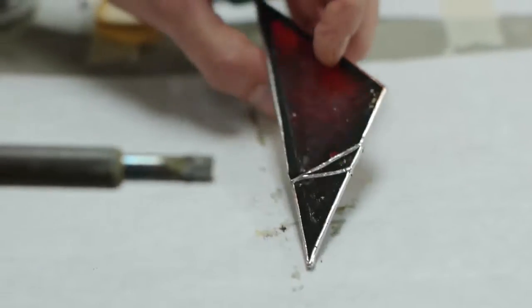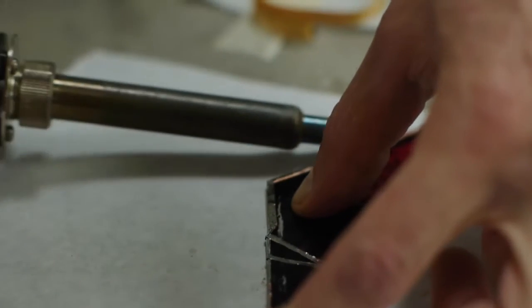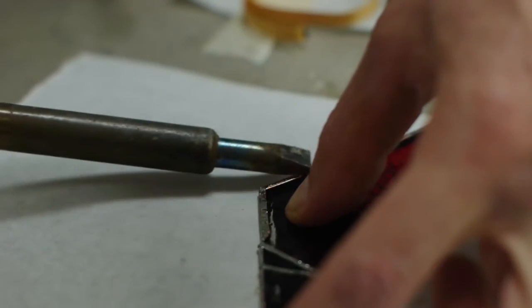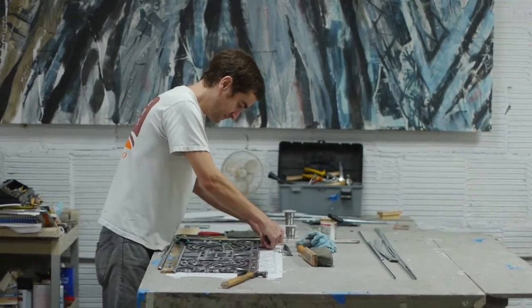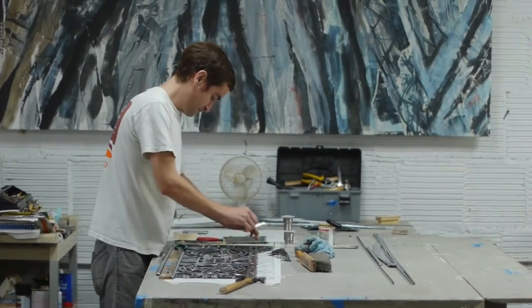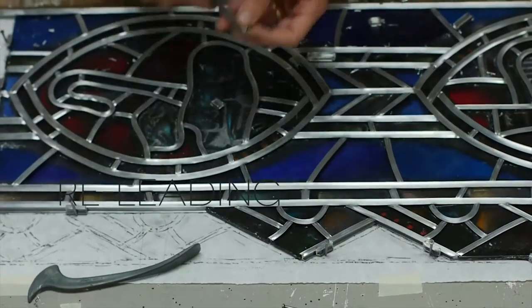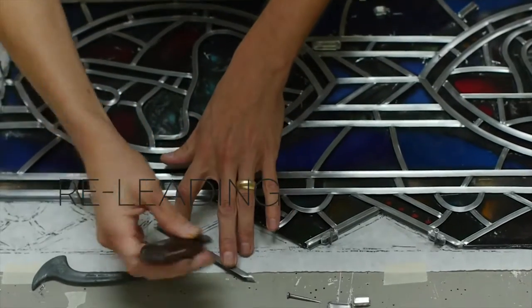One of the principles in restoration is you want to retain as much of the original glass as possible. Since we have all of the pieces, we want to put all of the pieces back in the window. Here you can see the glass that's been cleaned and we're starting the assembly process where the glass rubbing is laid out on the production bench. It's a very ancient process — leaded stained glass has been made the same way for over 1,000 years and our craftsmen still use the same tools and techniques essentially. When we start to look closely at Marsh's lead work, you can see that he's overlapping the leads.